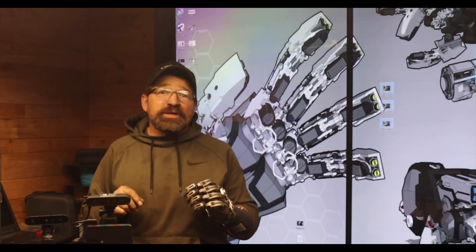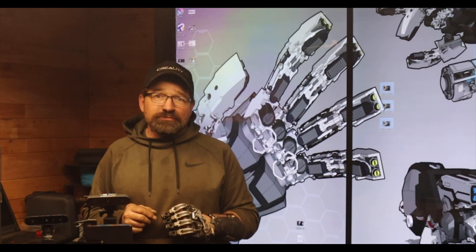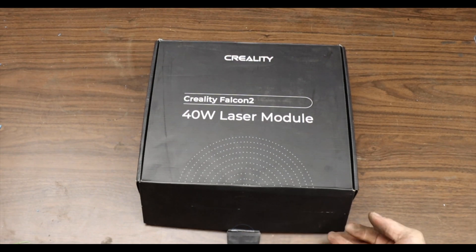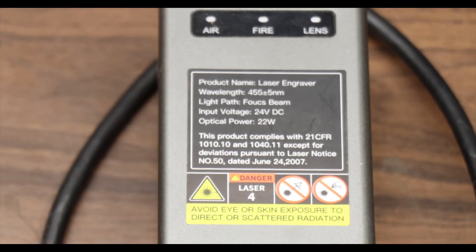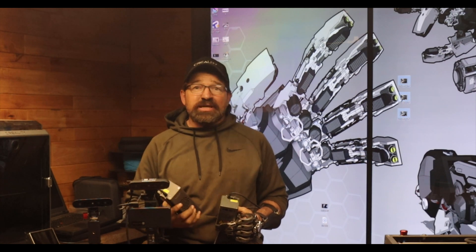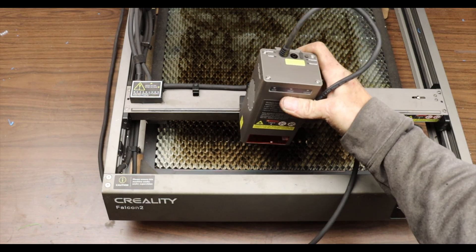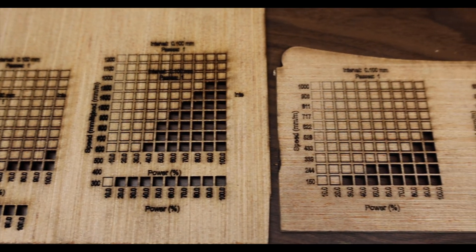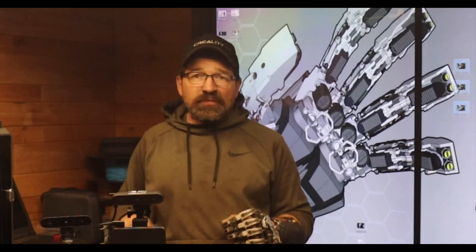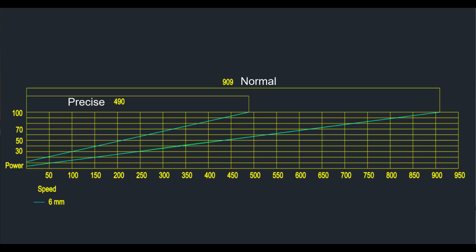I'm happy to say that last week my rep sent me a couple of boxes of upgrades and new products to try out. The first thing they sent me was an upgrade to my Falcon 2 laser engraver. My machine was originally equipped with a 22-watt laser module. Recently, Creality has released a more powerful 40-watt laser module that's a drop-in upgrade for the Falcon 2. The first thing I did was take some time and figure out what the new feed and speed graphs for the 6mm plywood that I usually cut are going to look like. The graph is very predictable and linear as far as the relationship of thickness versus speed and percentage of power for the cut.